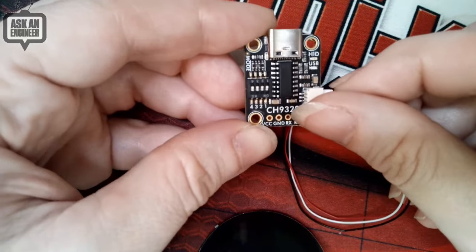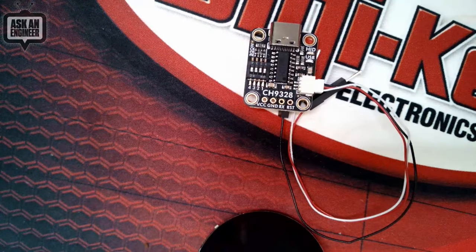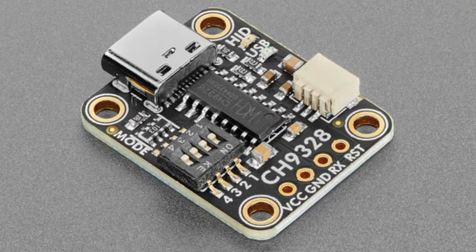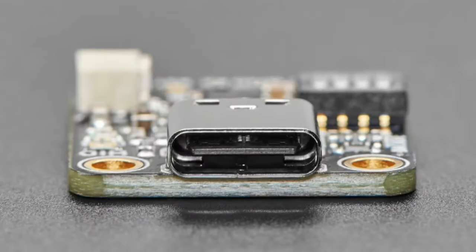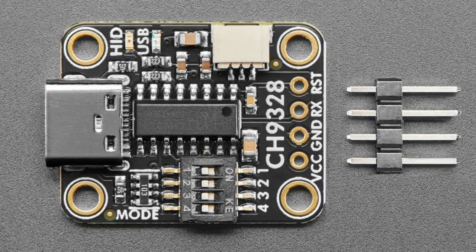All right, and we can answer a question for this specific one. What key map does it use, QWERTY, or is it configurable? Can HID send ASCII, Unicode too? It can. In the transparent mode, it only sends ASCII visible characters. If you want to send anything else, you use the raw mode, and you literally are sending the raw key codes. So whatever language, emoji, you can do it. You just have to know the key commands to send it. So it's like Alt, Control, dot, backslash x 521 or whatever. But yes, you can have it type whatever you like. And this works. Yay!